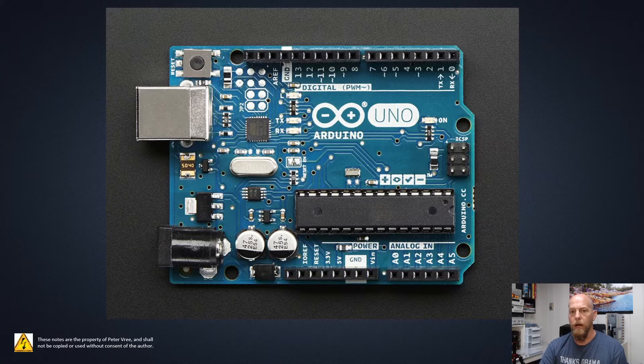This is an awesome step towards programmable logic controllers — PLCs. You have digital I/O, analog I/O, and a programming environment very similar to some PLCs. You'll learn about local variables and global variables, bits and bytes and words — all the different terminology you'd use with PLCs. So this is a great stepping stone. Hopefully, at the end of this playlist you'll have a good understanding of both the hardware and the programming, and when you step into PLCs, this will really help you out.